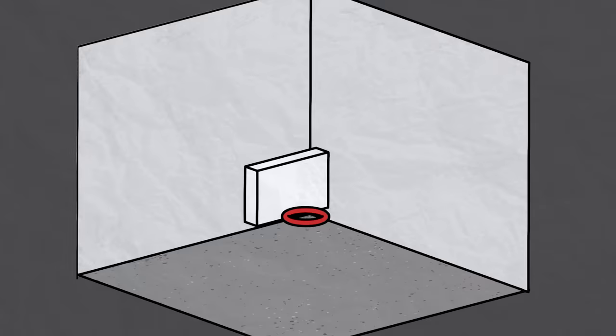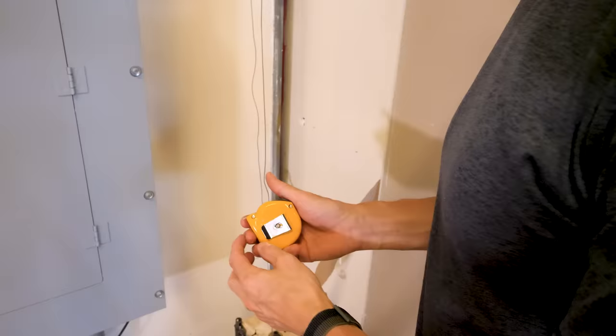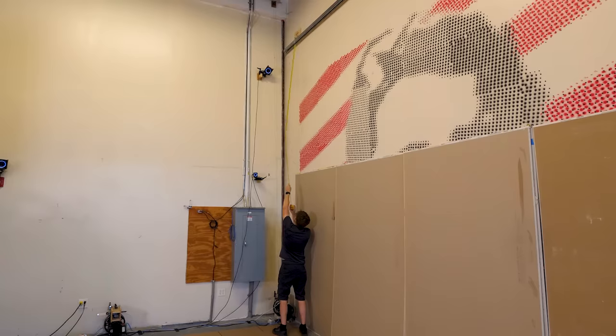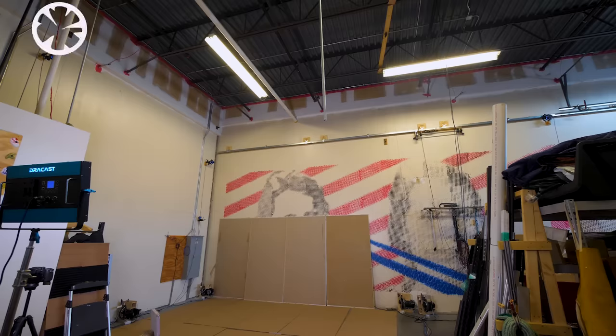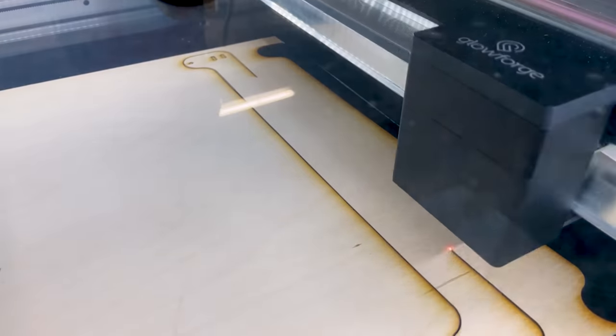The problem I'm having is actually a very practical problem, which is that I don't know where the pulleys are located in space. If I don't have accurate measurements for this, my inverse kinematic calculations are going to be wrong. A tape measure isn't accurate enough. I also can't use the tracking cameras for this because the pulleys are too far apart to fit in the field of view of the cameras. So unfortunately, we're gonna have to make a special tool and write a little bit more code.